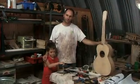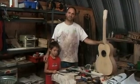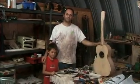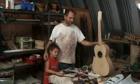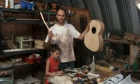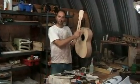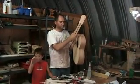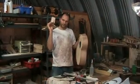It goes pretty quickly from here because the difficult work is mostly done. The neck setting is very time consuming typically, but I do like a pre-fitting and it helps the neck setting go faster. And basically what I've got here, as we talked about before, is a dovetail joint in there. If you remember, the way I did it was I cut the block prior to putting it in, and then I make sure everything's square and stuff like that, and then I cut out the material around the block, and then I've pre-cut this dovetail on the neck.